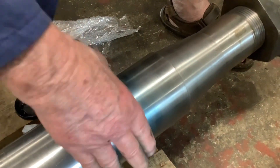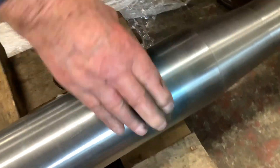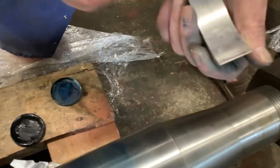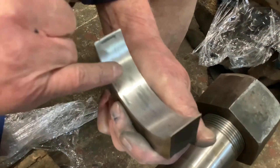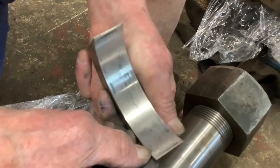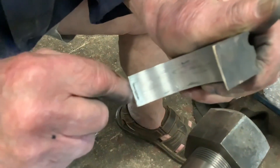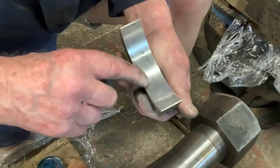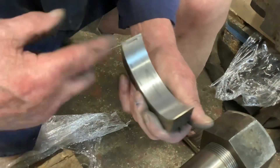So now you're just going to do a repeat of the process you did before? Just put that on there. I can see now we've got some even better marks. What do you mean by better marks? We've got a heavy mark here, there — those are high spots. High spot there, one up there still, one there, and one up there. So we're getting close. And even there, I reckon we're talking microns.